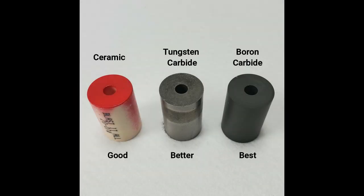Nozzles are made of different materials offering varied lifespans. A ceramic nozzle, the most inexpensive, is good for general light duty use with glass bead and less abrasive media types like plastic or soda. The tungsten carbide nozzle is a medium duty nozzle — it works well with aluminum oxide, glass bead, and just about any medium. The best nozzle available is the boron carbide: it's the toughest, lightest, and lasts longer than any other nozzle. All nozzles are available on the Blast-It-All online store, and we have online chat to help you find the right nozzle for your application.